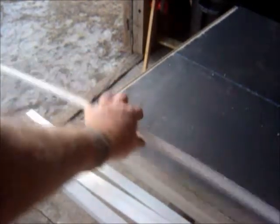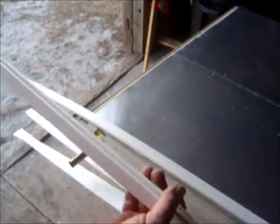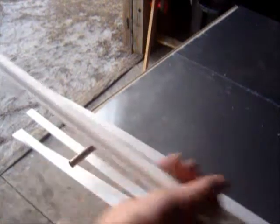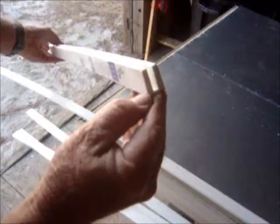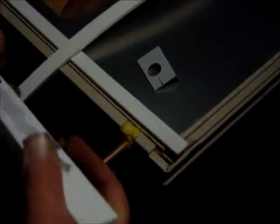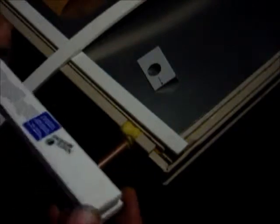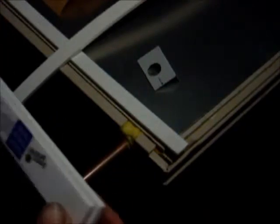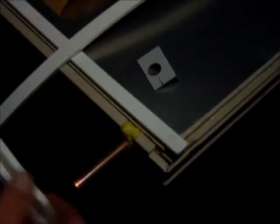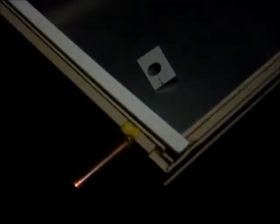We're going to put on these vinyl strips that I've cut and made out of this stuff I found at Lowe's — it's a vinyl fencing track. You see the profile. What I'm doing is just cutting this right off right here. I get two pieces that are a little wider than three-quarter inch, and they have a little small bevel, probably two to three degrees. That's not really a big thing for this project. After you cut it, you may get some feathering, and a little bit of 100-grit sandpaper takes that right off. Then you've got a durable trim molding for these right here.